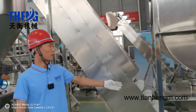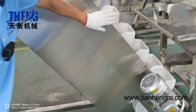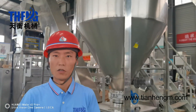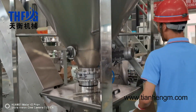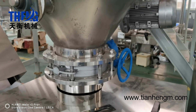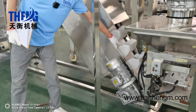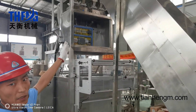This is the second powder feeder machine. The powder will also be driven here and go upward to the steel tank. The steel tank's capacity is also 2,000 liters. This is the outlet valve as well. Then the powder will be fed to the bucket elevator conveyor and into the automatic packing machine.